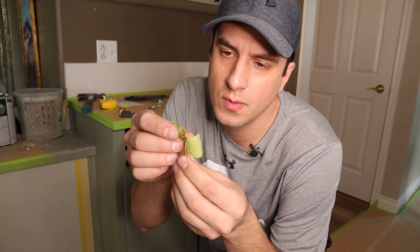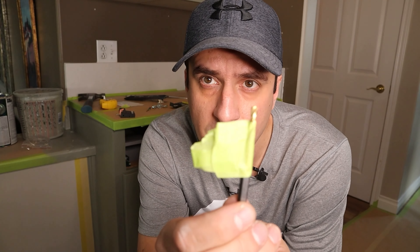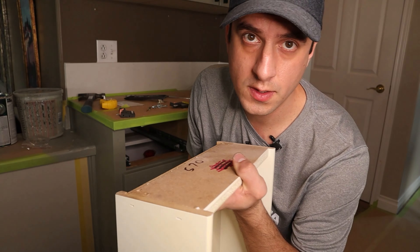I just did my hole. In order not to mess up, you want to put a little stopper on your drill bit — some sort of flag made with masking tape. When it spins, you can see where to stop. That's it — I know where to stop.